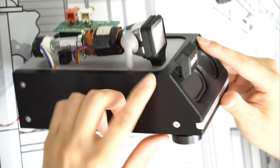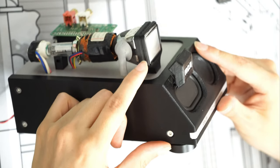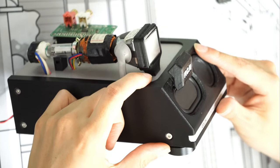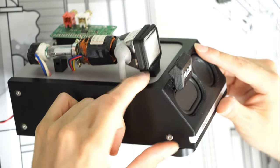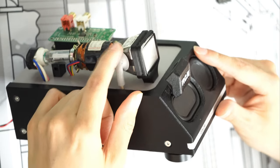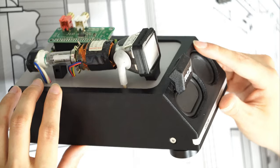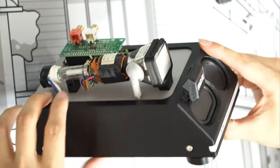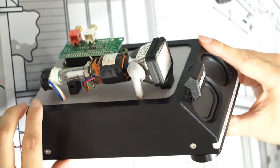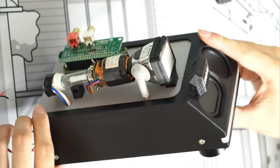So what I did is, inside this little cover shroud thing that holds the CRT in place, there is a wire that goes through this and touches the aquadag at the bottom of the tube right here to make contact. Otherwise, it would create a whole lot of weird stuff, interferences, I think. And obviously, when you touch it, you could get zapped a little bit. So now you don't, because it's properly grounded.